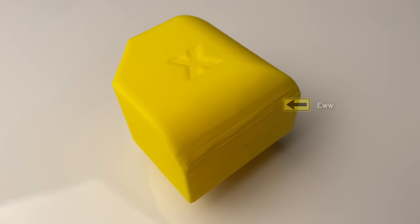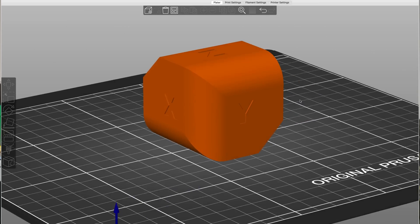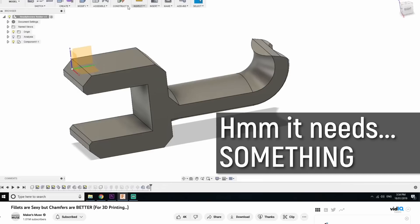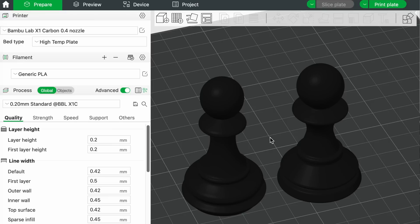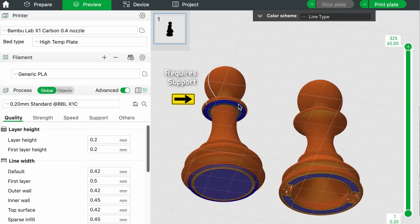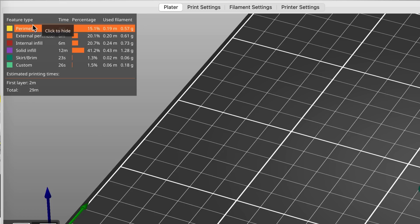Another item to consider are fillets and steeply rounded surfaces on the top and bottom of your parts. The more non-linear areas there are, the greater chance the layer lines will be visible, thus calling your printout as 3D printed. If you're making your own design, Maker's Muse has an excellent video going over why chamfers are actually superior to fillets — I'll have that linked below. Last up for model selection is considering how and if supports will be used. For example, if I wanted to find a chess pawn model and I found these two, the one on the right wouldn't require support, but the one on the left likely would just due to the overhangs in the design.